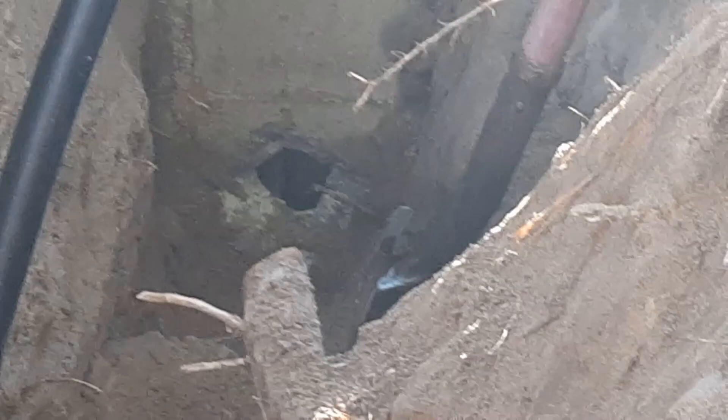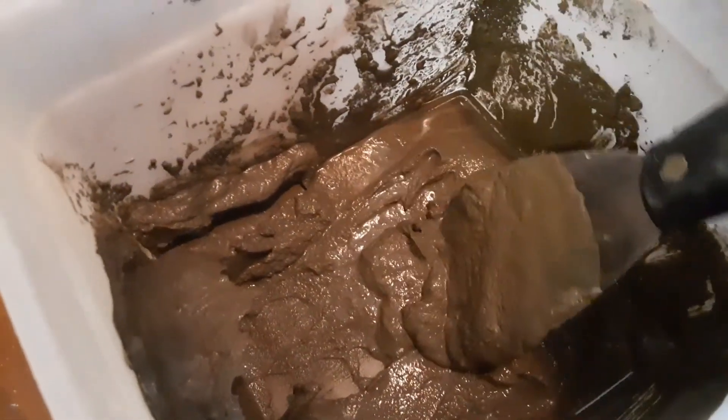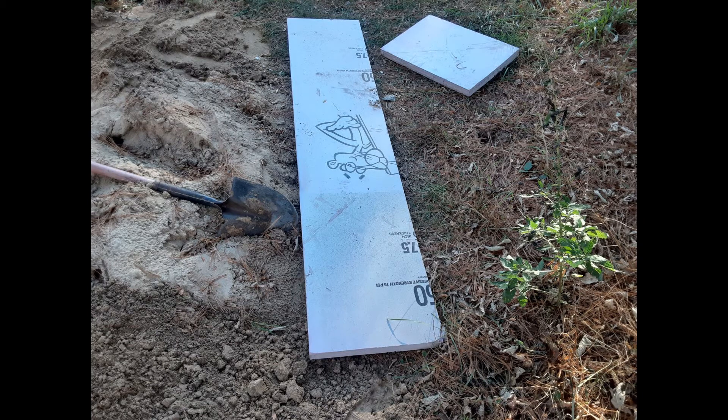You kind of want it kind of tight because then it's less filling you need of the mortar. I use hydraulic cement, and I'll show you that coming up. Once you get it chipped out, just do a dry fit — see if your pipe fits in there. If it fits nice and snug, you're good to go. You can see how the back side blows out. Remember to put hydraulic cement or watertight cement around the pipe. You want that consistency of barely hanging on — it drips, but you don't want it too runny. Go on the inside, around the pipe, underneath the pipe, and then do the outside. Make sure that pipe leans down a little bit, dipping down to the outside.